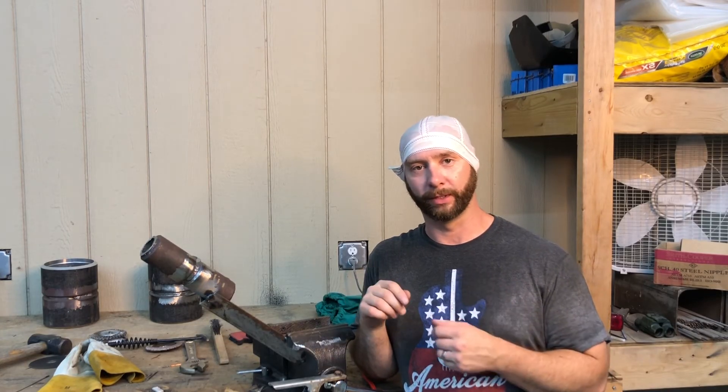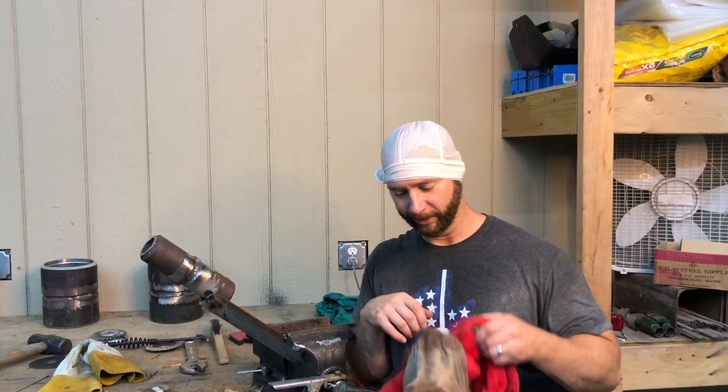So that's all of this video. I hope you learned something. I hope that helps you out on your TIG root. If you get that gap just right, you can just lay your wire in there and basically just run over it. Just burn it hot. I put my root in at about 120 amps with a 1/8 inch 70S wire. That's the way I like to do it. Seems like when you do 1/8 inch, you don't have to fight or worry about any suck back — it just lays right in there. Normally you'll have a little push-through, which is what you want. You definitely don't want any suck back. One-eighth wire, tight 1/8 inch gap works great.